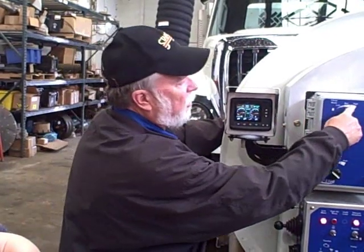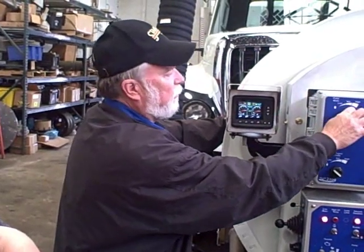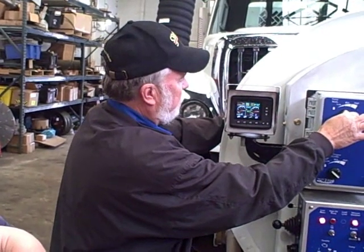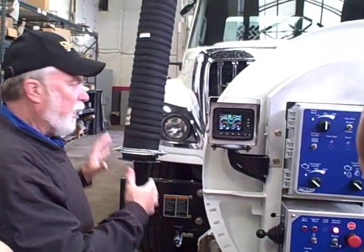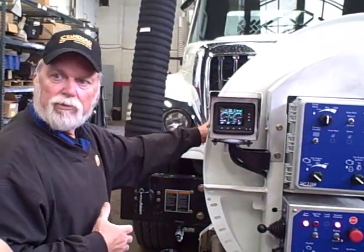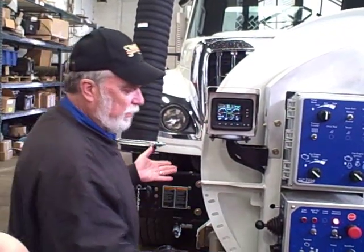When you want to use this hose to rod, you're going to go to mid or higher range depending on what kind of nozzle you have. Put this one on and what that does is it engages the second PTO. The second PTO is for high flow. When you engage the second PTO, you do that basically.